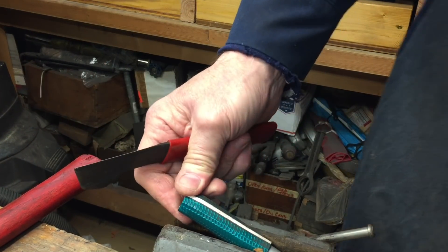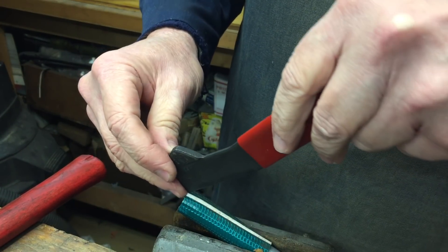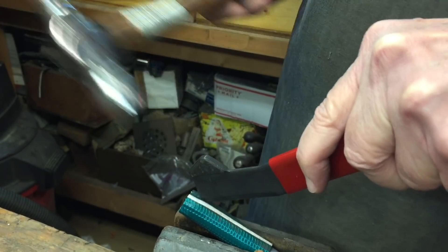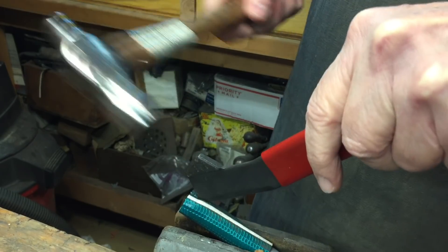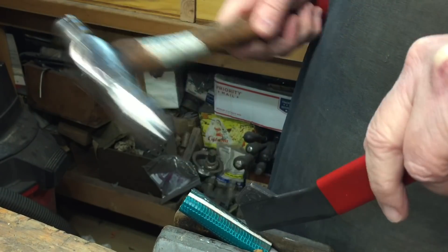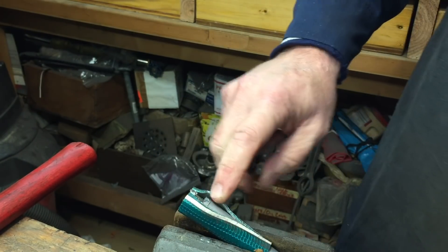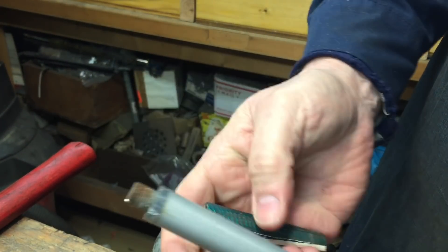Here's a quick example. If this were some kind of sheathing around a cable — wire insulation, fiber optics, something you had to get into — you would take it like this and strike this surface with a hammer. You could split into the sheathing and work your way down until you split it open, as you can see here. This way you get access into that cable all the way down, working it like this. You can see how it splits open — nice, clean access without damaging the pipe inside.